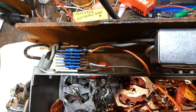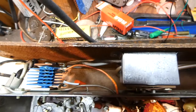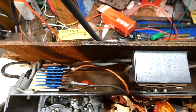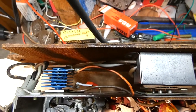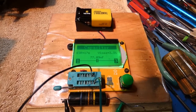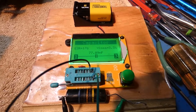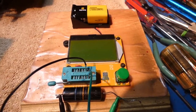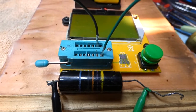There were some issues with it and I've already started to sort it out. As you can see, it's got the selenium rectifier, and if you look in there you can also see a modern capacitor that I've already put in there. That was a fairly ugly bumblebee cap — they're really terrible. This is a 0.047, and although it's still in physically good shape, the value was not quite double and it's a little bit leaky, which is actually a nice indicator telling me this radio probably did not have a lot of hours on it — it sat quite a bit.